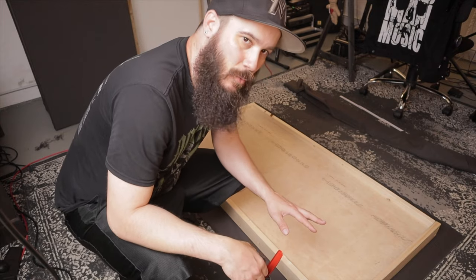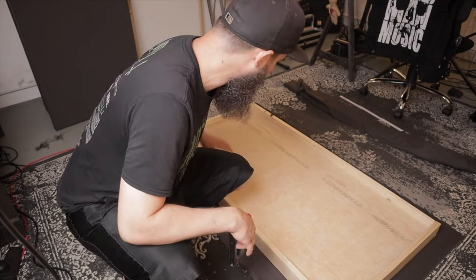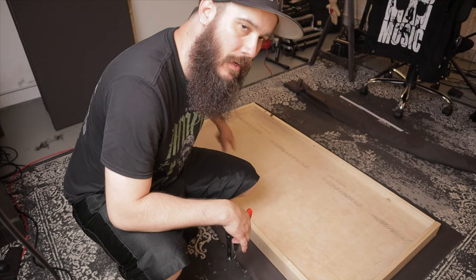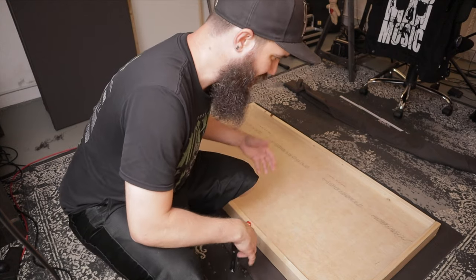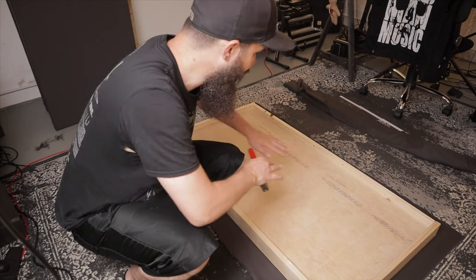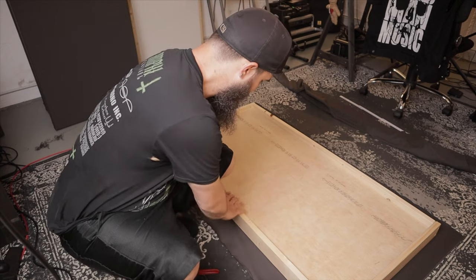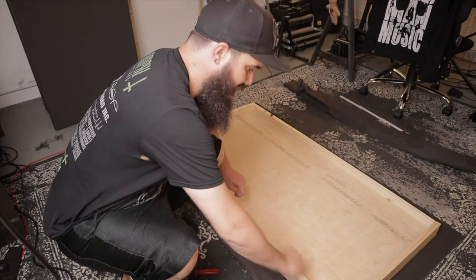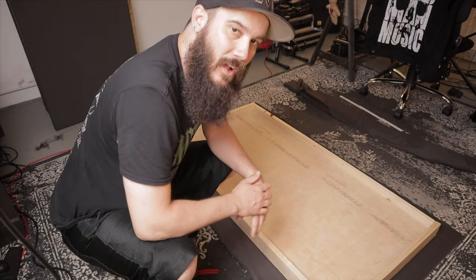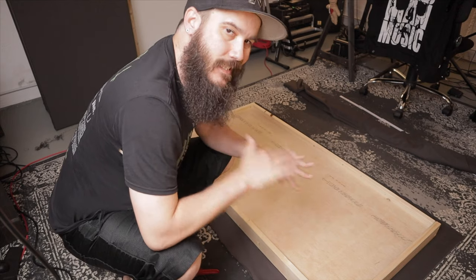The idea when we staple, we're gonna put one staple in the middle on each side. So four staples, one, two, three, four, right in the middle. This way it's already pulling the middle of the fabric to each of the sides of the frame. And then we'll go in both directions, starting from the middle on each side and pulling it tight around the entire edge, making sure that our fabric stays nice and smooth.